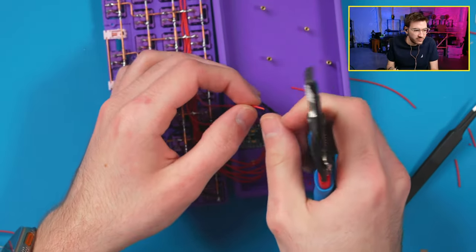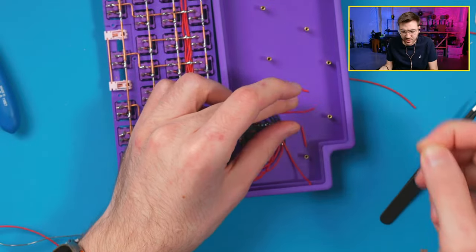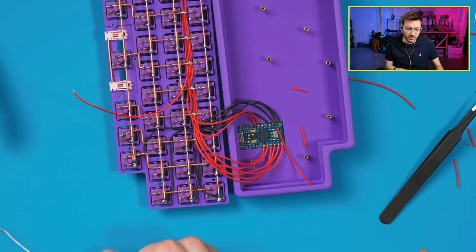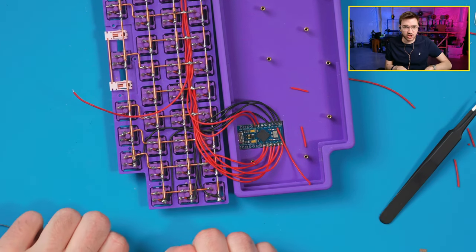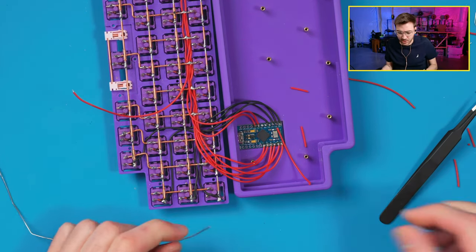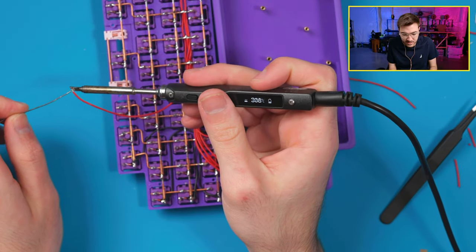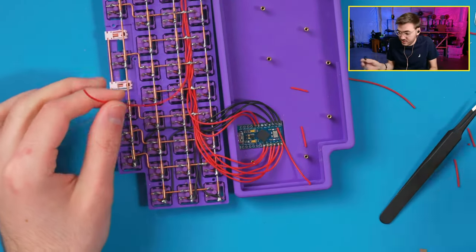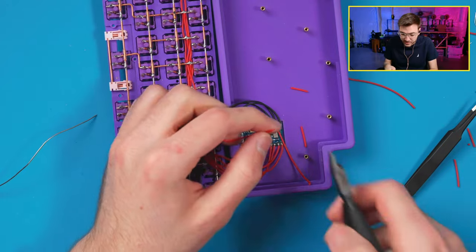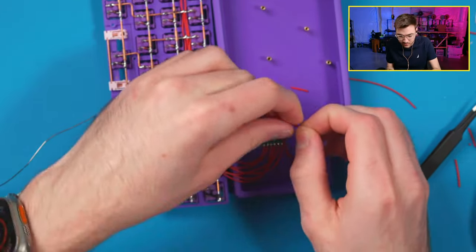You don't use a fan for the solder fumes? I do. Well, I don't use a fan. I use a HEPA filter. Something common that people will think with solder fumes is that you can get those little fume extractors, right? That have a carbon filter on them. And all that does is remove the smell. A HEPA filter actually catches the stuff in the solder, right? It catches the flux fumes and all that. So you want a HEPA filter, and that's what I run it through. I have a big HEPA filter to my right that's kind of filtering everything for me. Keeps it real clean down here. I didn't always use that, and ever since I started using it, I feel better after soldering for hours. I used to feel like trash after soldering before. I felt really bad, but now I don't anymore, which is nice.